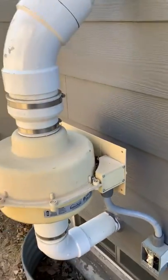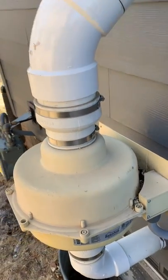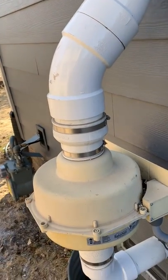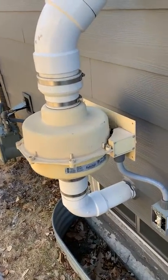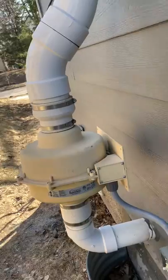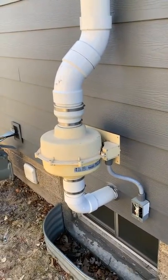No need to replace the fan. There is some gunk in here — you can hear maybe some sticks or leaves that fell down in there, so I'll take that apart and clean it out for her. And you can see that fan's not level, so I'll level it — it'll increase the life of the fan bearings.